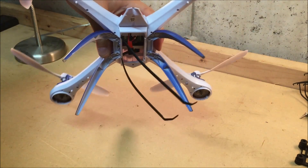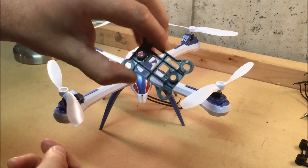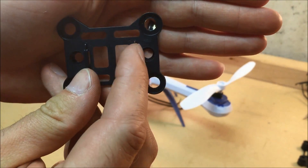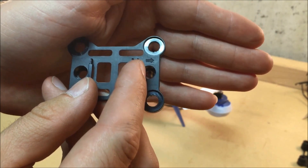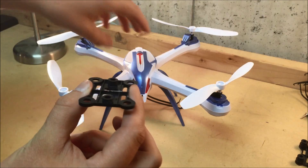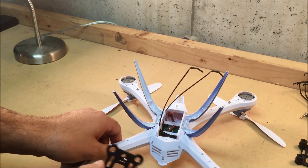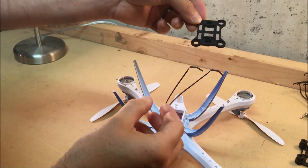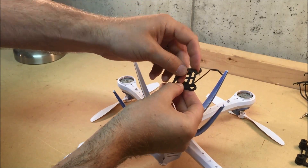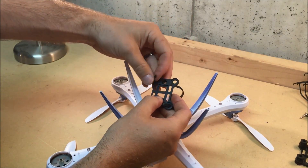Once you have both cable ties run through the first loops of the quadcopter, take your lower plate that we prepped earlier. There's an arrow on it that points forward — that's the front of the plate. The side with the latch is the bottom, so you want the plate to hang from the quadcopter that way. The easiest way to do this is to turn the quadcopter upside down, take your plate, make sure it's positioned properly, and run the first zip tie through the top of the plate and then back down through the bottom. Do that with both the front and rear zip ties.